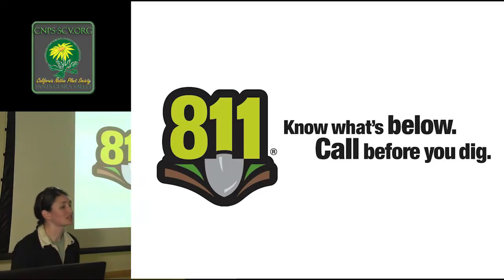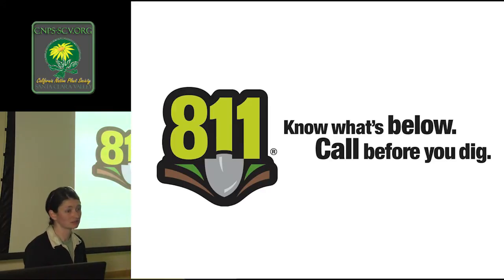Like I said, there's a lot of utilities within the right-of-way, so you should always, it's actually law, before you dig in those spaces, call 811. It's free, and a person will come out and mark with a spray-painted code where all the utilities are within your park strip, so you know exactly where it's safe to dig. Like, do they usually need just 48 hours notice? I think so. Yeah, it's fast. It's really fast. Whish, bang, boom, they come out, and it's completely free. Don't have to pay anybody for it.